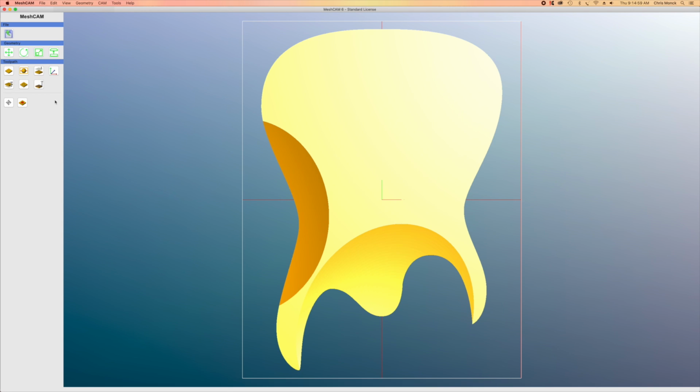So now what I can do is start to indicate where I want to carve, and this allows me to set up a region that will tell the program this is where the router needs to carve. So I'm going to select a polygon selection tool, and I'm just going to draw around the shapes that I'll be cutting out here. And for this first carving operation, it's only going to be the comfort contours that I have carved into the back of this guitar body. So I'll set the first one up and then I'll grab the polygon tool again, and draw around the second comfort contour at the front where the neck is joined to the body. And this way, as I'm carving, it's only going to be carving within that area and not the entire surface of the guitar, so it saves a great deal of time.